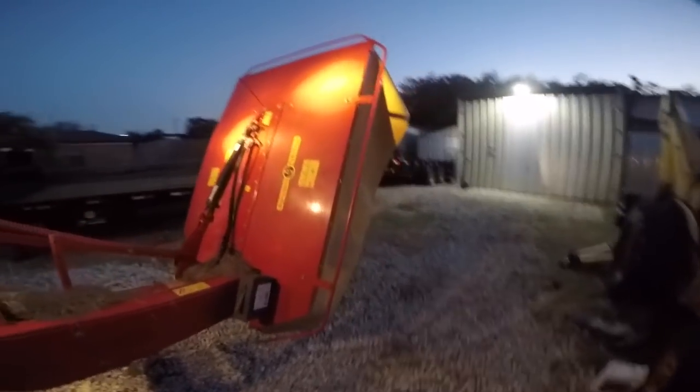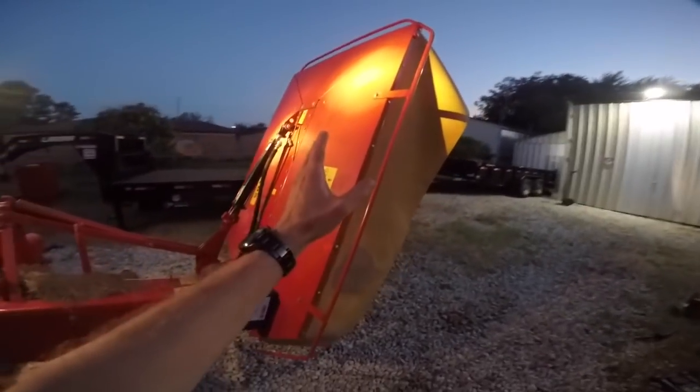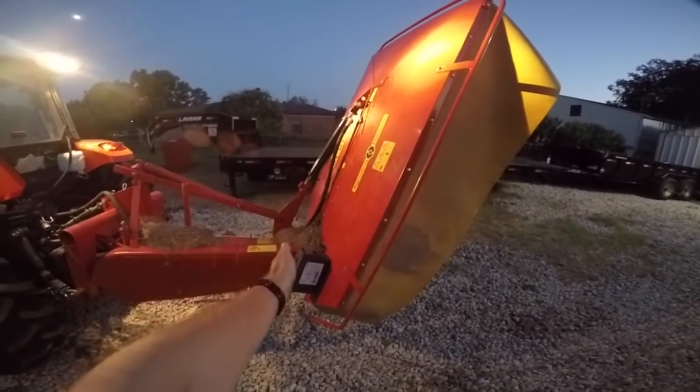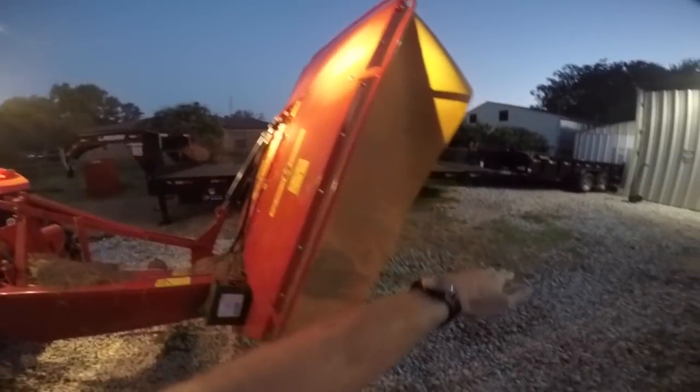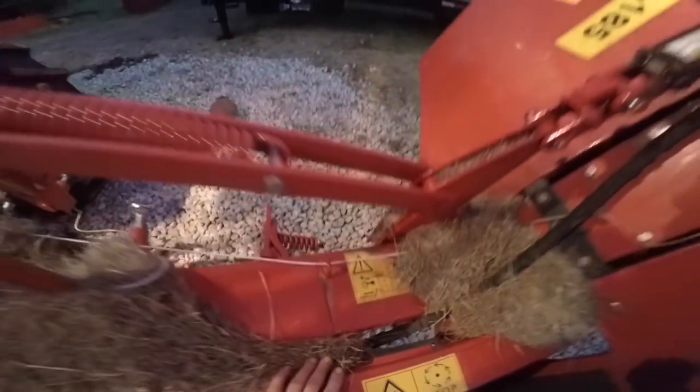The obvious thing a person would say is, why don't you just let down that hydraulic cylinder? Well, the problem with that is it takes the weight of this section here, which really now is pretty close to straight over this pin. It takes it and it cantilevers it out, so every little bump beats the rest of the mower part. Learned that one the hard way. Some of you guys saw the welding repairs I had to do to it.